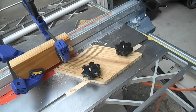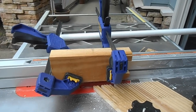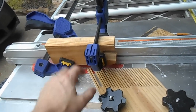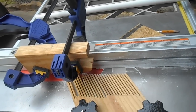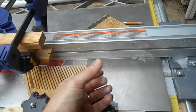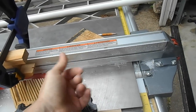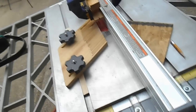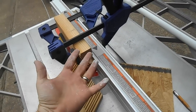It's just a standard feather board — I've got a video further back in my channel, I'll put a link that'll take you back to making feather boards and these homemade knobs. And then this is just a scrap hunk of 2x4; in the early part of the setup you saw how I set it on there to get the height, and I just rounded the front edge here on the disc sander so the piping would feed under there smoothly. But boy, that stuff makes a mess — it leaves a fine, fine, fine powder. So if you're going to be cutting very much of that, I strongly recommend you wear a face mask, especially if you can't cut outside. If you've got to cut it indoors in a basement or something, don't breathe that junk. This fine plastic powder could probably wreak havoc in your lungs. So just be cautious.